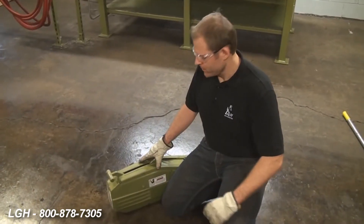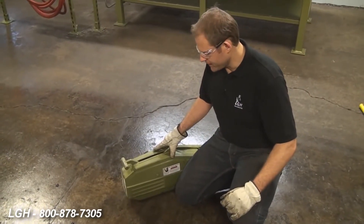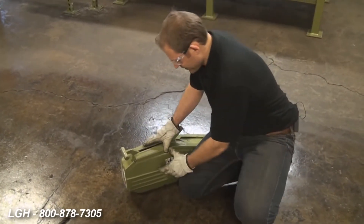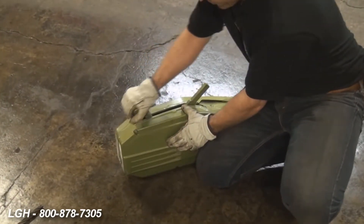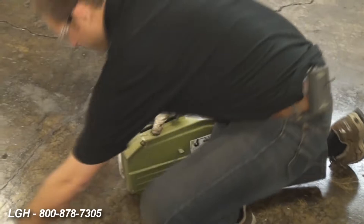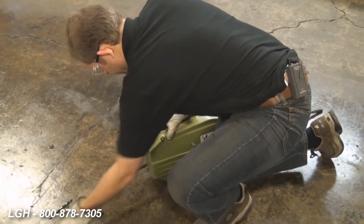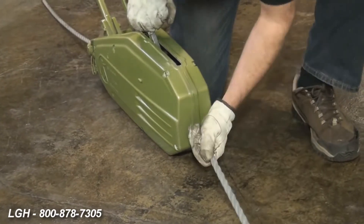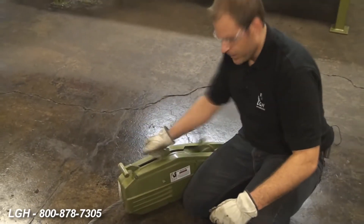For openers, we'd like to demonstrate how to load the wire rope into the hoist itself. It's actually a two-handed operation, so with a free hand, there's a spring load mechanism on the side. Press that with the other hand, move one of the handles back. Simply grab the wire rope, push it through, repeat this operation in reverse, and now your hoist is engaged and ready to use.